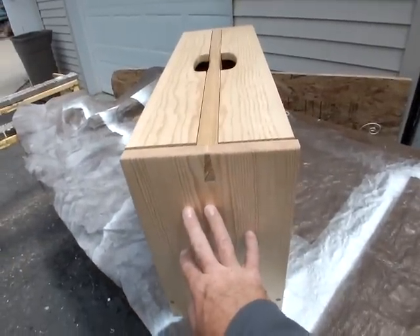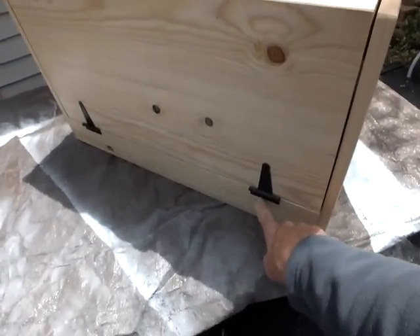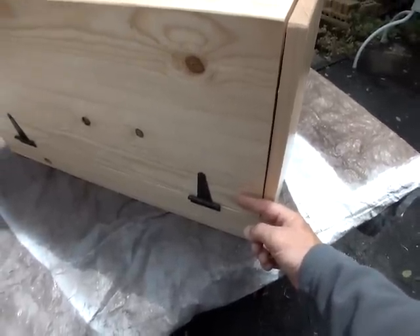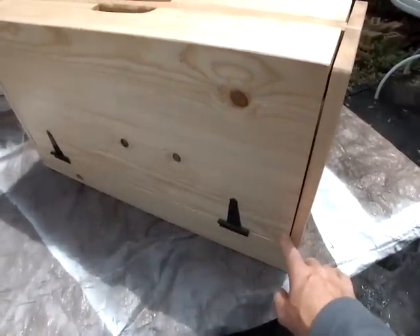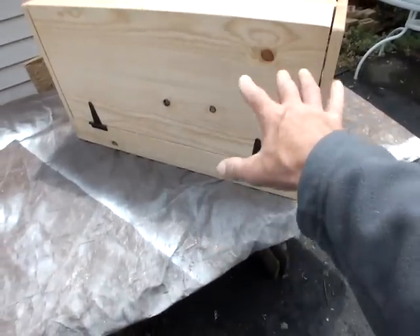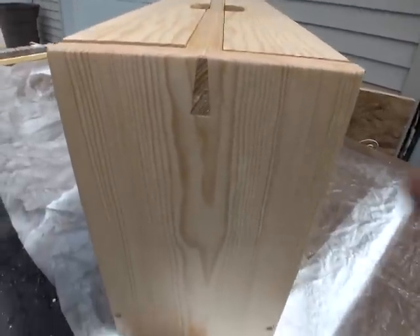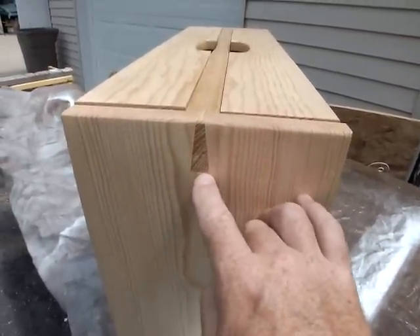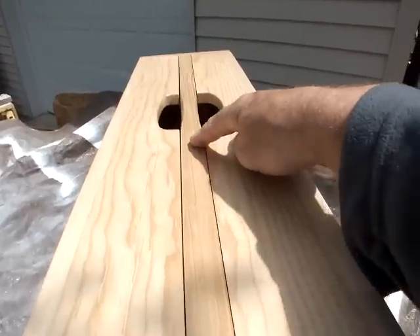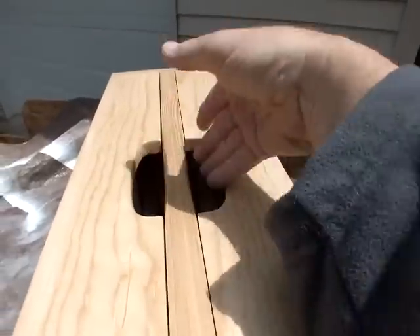I think he would call this the posh version — it's solid pine, American pine. I joined some boards for the side and used his beefy screw-through pivot hinge on each end, which was hidden. I like the concealed aspect, but I went with a strap hinge instead — I like the look. I changed dimensions to carry more stuff. Like his design, my handle is a dovetail tenon for an oversized cross rail that is your gripping point.